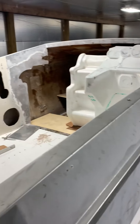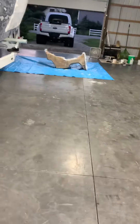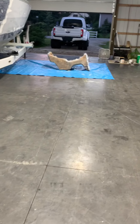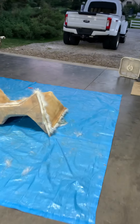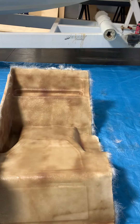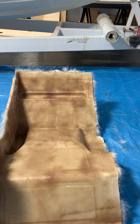I concentrated on the walls, the stringers, and the transom. Those two are obviously sitting in there — that's our last one right there. After we knock that one out of the mold this week, we will be ready to fit them all. Hopefully the following week we got our rubber engine block to start knocking up blowers and all that stuff. We got gel coat in this one and then the first round of fiberglass mat, which gives it the shape. You take that mat, brush it and get it in all the corners.